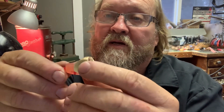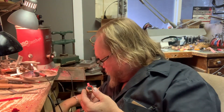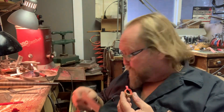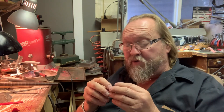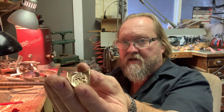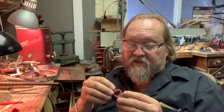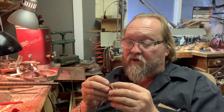Not going to be a problem. What I'm talking about is sheet wax on the mandrel. I just cut some sheets and wrapped it around. I didn't film it — it would have been a great little job. I've got the sprue on it. It's all soldered down and repaired on the back, the broken pieces that were missing. So that's ready to go now.